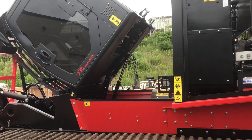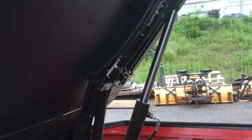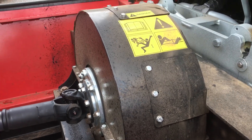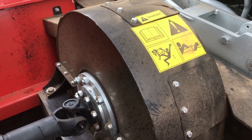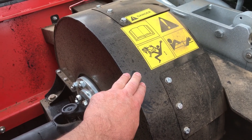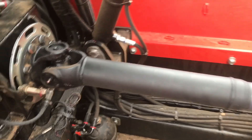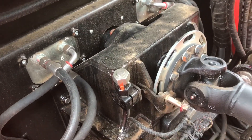That allows you pretty good access under the cab. Let me show you what's under here. There's a safety rod, but here is your turbo clutch housing running off the back of your gearbox. This, for lack of better terms, houses a torque converter with a heat-set plug in it that acts as a fusible link if you stall the head too long. There's a standard drive shaft that goes out to the front where the attachment hooks up on the other side.